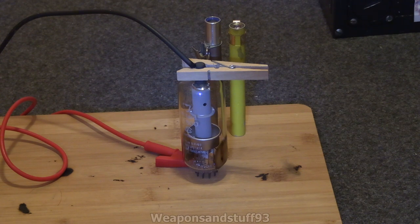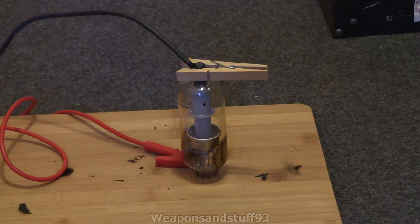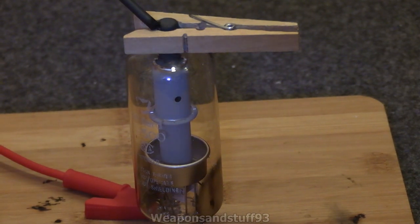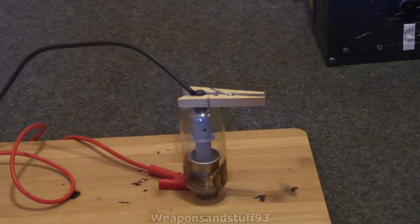This scatters x-rays pretty much everywhere — it doesn't send them in a uniform direction. Right, that'll be enough. Let's inspect the damage. The pen that was 0 to 50 millisieverts is on about 1 millisievert. The 0 to 200 Roentgen pen shows the needle has moved, but not enough to be a clear figure. These dosimeter pens have definitely absorbed some x-rays. I've got the MD3 set up for one final test — it still has its original calibration from the early 2000s when the MOD retired them.